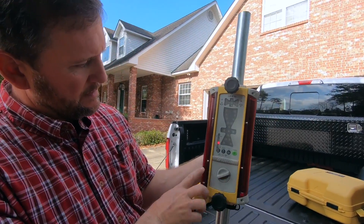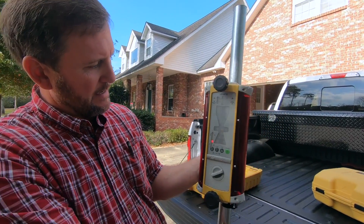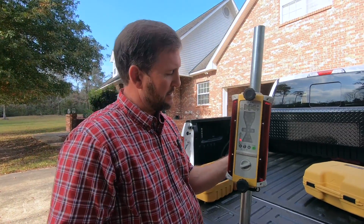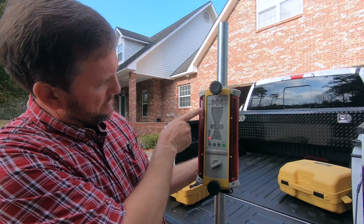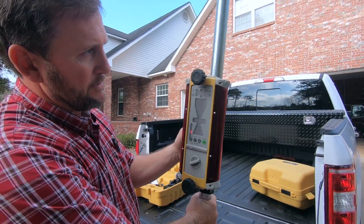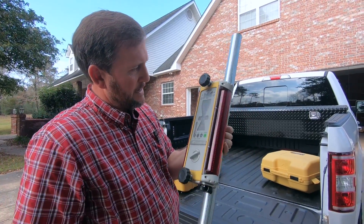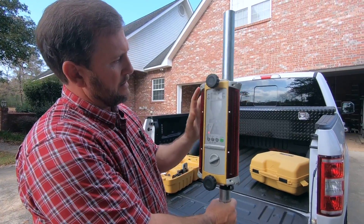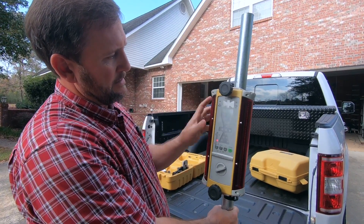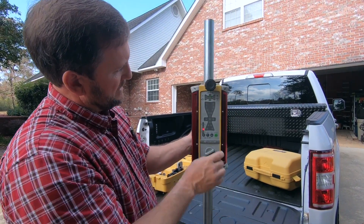In the video I'm digging a ditch and I'm using this on the stick out there, but I don't explain it real well in the cab because it doesn't sound great in there. Up here, this is going to show whether you're plumb with an excavator, because the excavator's stick is going out and back like this. You change it when you're on the dozer to tilt — you're going to be tilting the blade on the dozer like this.